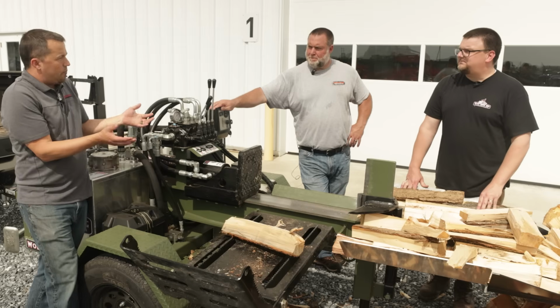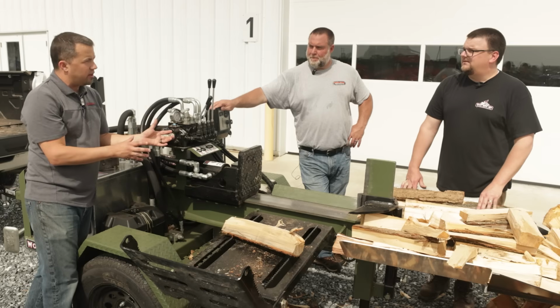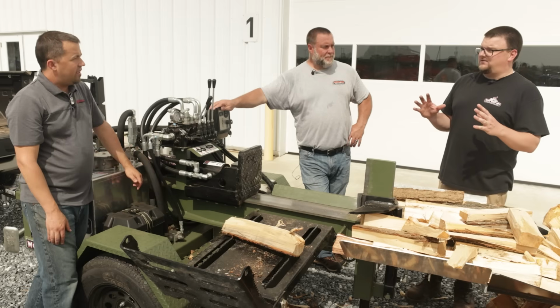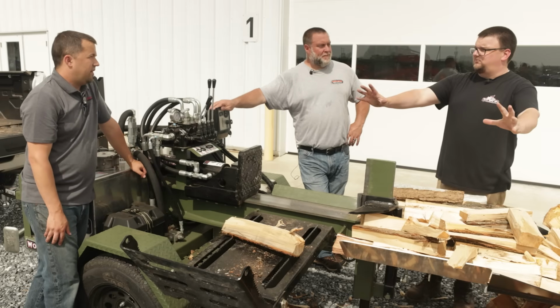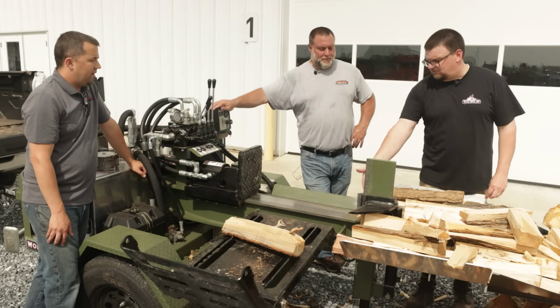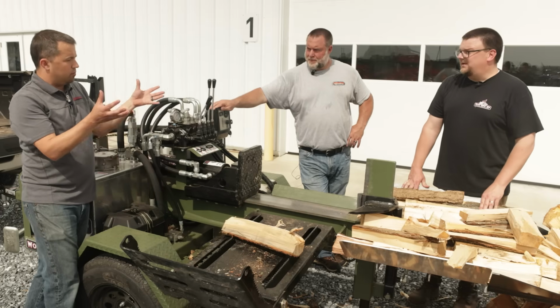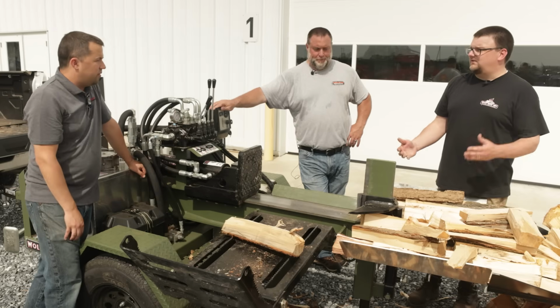So in terms of operating technique then, when you have those larger wedges, do you change the way that you're running the machine? I try to center. Running a 12-way wedge, I'll try to center it as best as I can so that I get the most uniform splits coming out of it. But I'll always still put the crooked end towards this way. Because you're going to do less re-splits, I guess, correct, with the more ways, but then you end up with more trash. Exactly. So it's a trade-off.